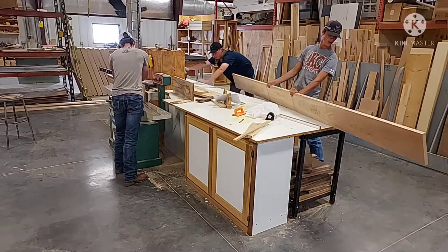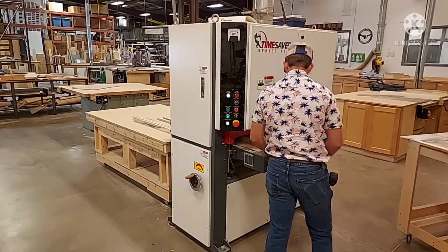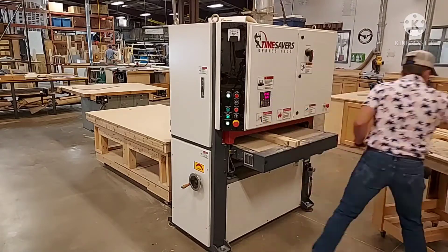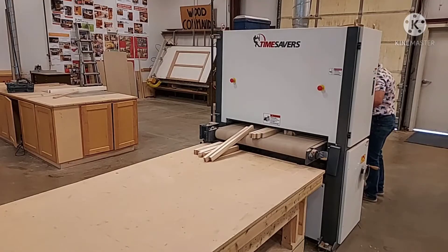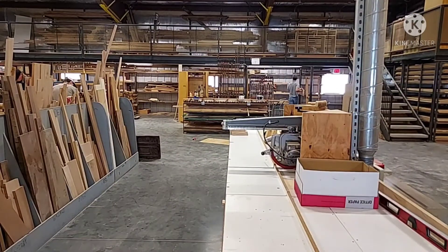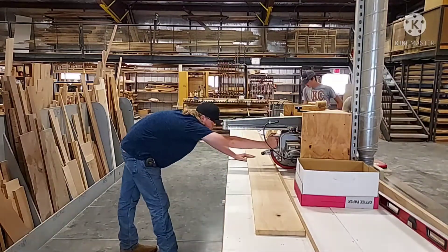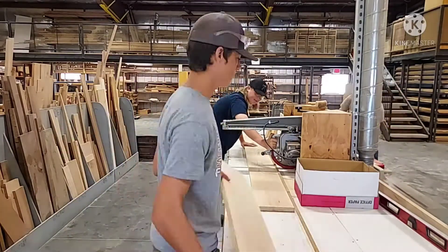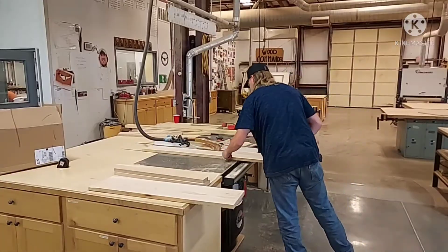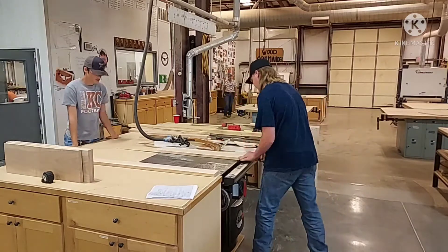We are rolling in the wood shop second hour — not quite everybody yet, but we're getting real close. Sometimes at the beginning of the year there's a lot of waiting on the saw and the jointer, but kids normally have enough stuff to do that if they're waiting on one machine they can go start on something else. Basically they're going to pick a part of their project — either a side or a face frame — and just start making pieces for it. Cut all those pieces a little bit oversized, rip stuff at sixteenths bigger so we can run it through the sander on the edge to get rid of saw marks and jointer marks. Once we have a whole set, we'll surface and sand everything down to the right thickness, finish the length, and then do some assembly or routing — whatever the next process is.